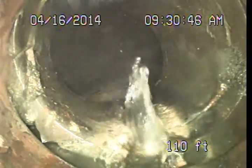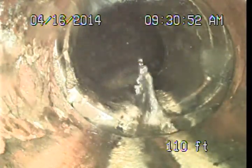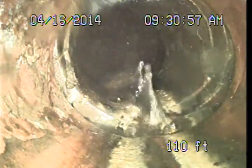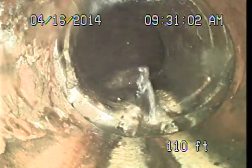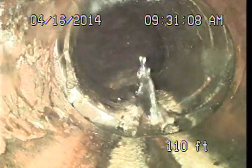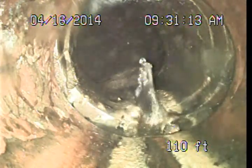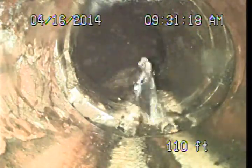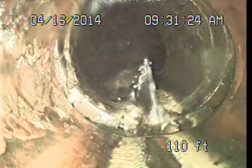So unfortunately this is something that's definitely considered damage. It's kind of tough to really determine what the best method of repair might be, since the concrete pipe would benefit from a lining system. They might be able to continue through here and line all the way through the city connection with a component known as a top hat as well, but that determination really needs to be made by the sewer contractor. If excavation is necessary here, that could be a more significant cost.